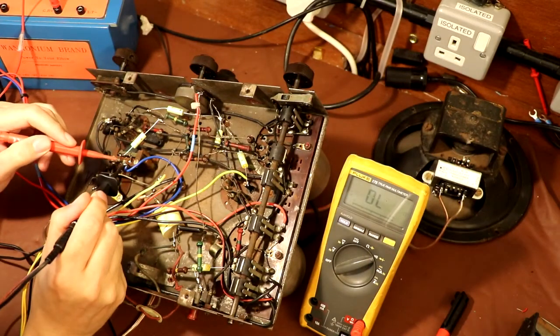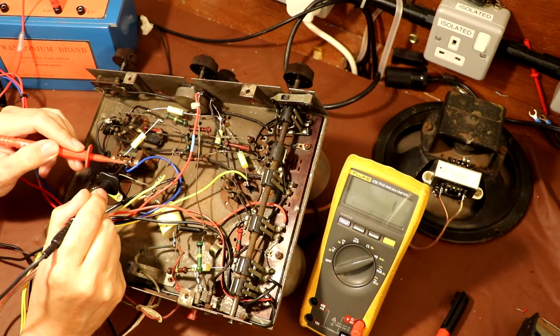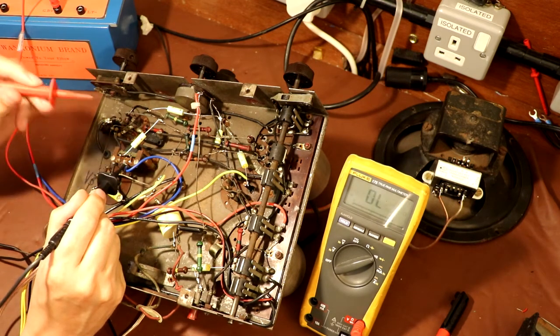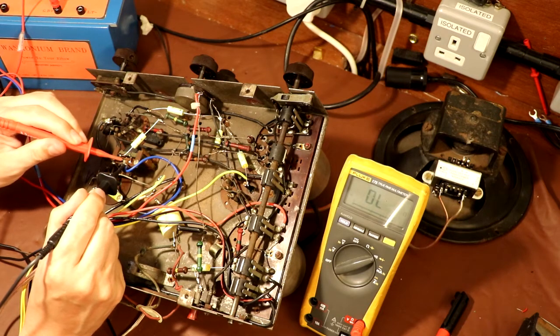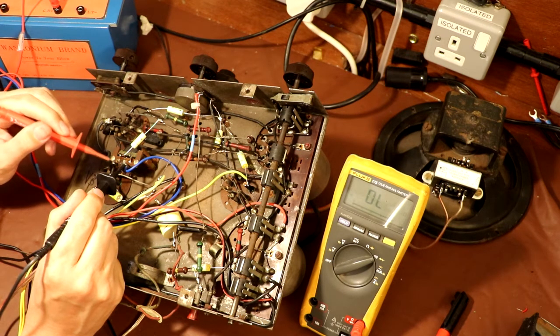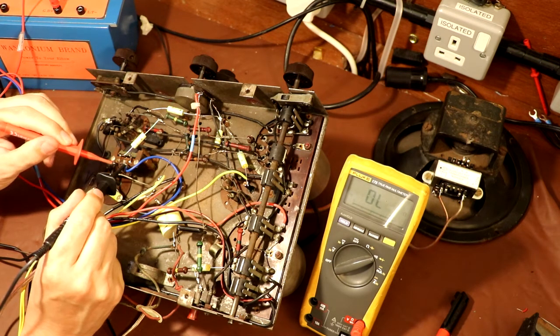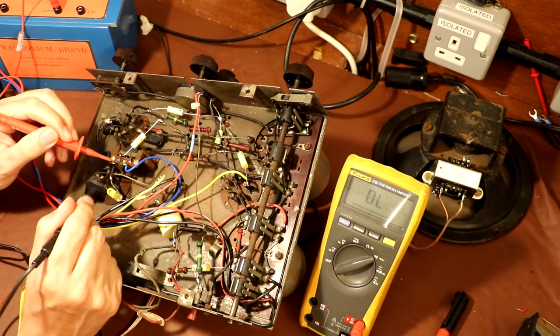So I've just put our meter on the ohm setting, so let's just check the connections there. Okay, we've got a beep, so the meter's working. It's got a centre tap, which is not really a centre, it's towards one end of the auto transformer. So we should have continuity to there, which we haven't. So we're probably not going to get continuity to the far end, which we haven't. And then I'm going to go from the far end to the middle section. So amazingly, our little audio level auto transformer here has some serious problems, because it just happens to have every connection open circuit.